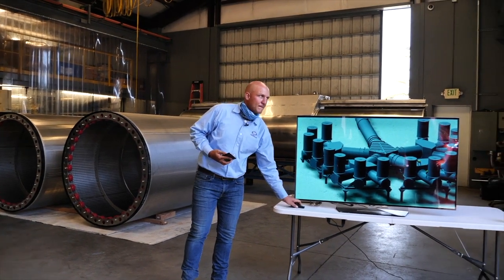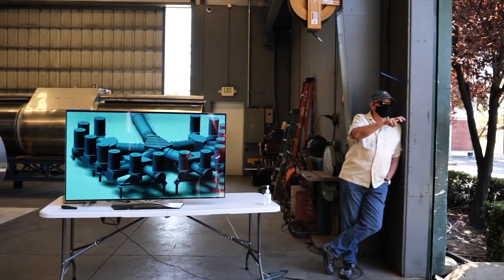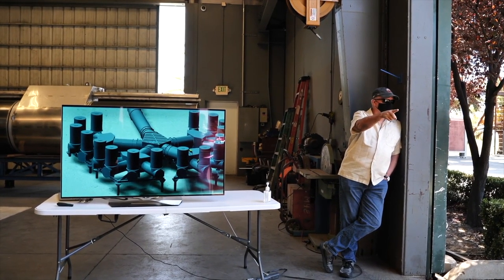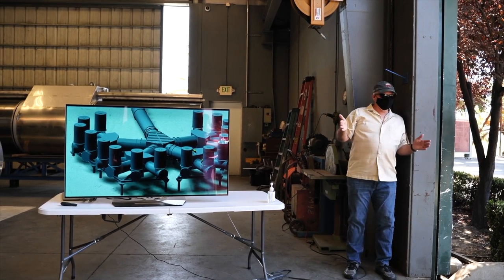Yeah. Okay. So some of the stuff I showed you in the meeting, the total structure length is 964 feet. The screen length is slightly smaller. We put a foot between them, which can be verified during final design. We might be able to skinny that up a little bit, but right now we have a foot between them. And then there's a little bit of room on the ends of the concrete structure because there's stuff inside it that we have to be able to get out, and that's on the ends. Okay, so a little bit longer than 900. Yeah, and that's actually shorter than the vertical plate ones that we've also been talking about.